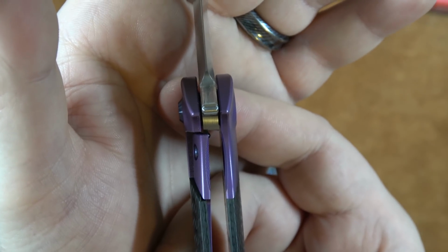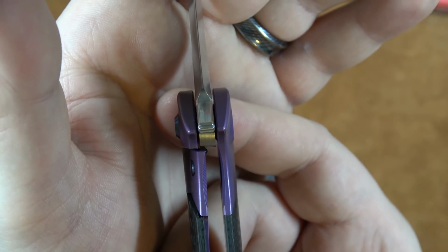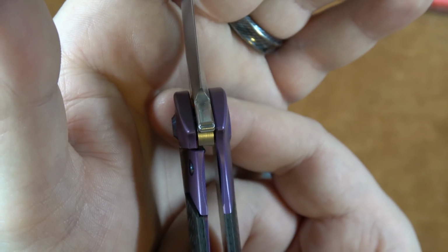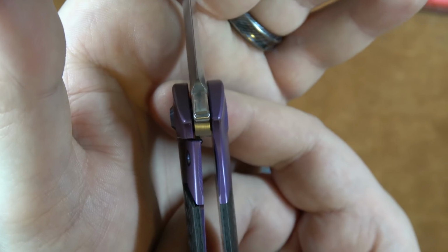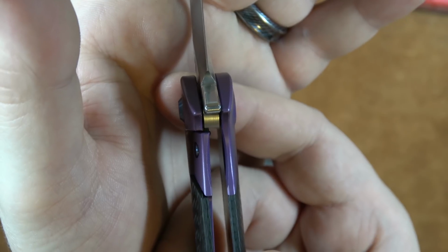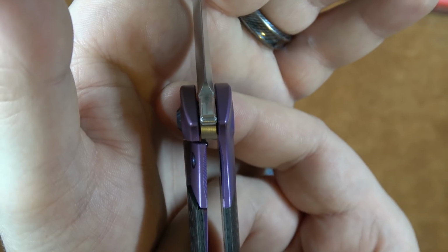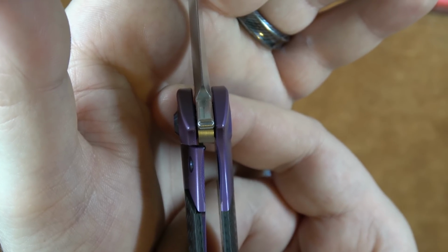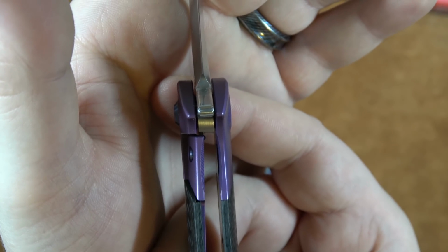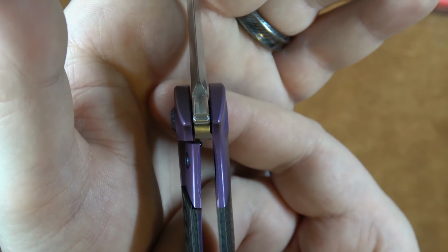And oh my God, some company needs to fix this, because, okay, hang on. Hang on. The little lock bar piece down in there, and I don't have one out here anywhere to measure, but we're talking between 40 and 60 thousandths. That's as thick as it is. That's the most amount of interface you are going to get between those two parts. So as long as you're getting that interface between those two parts, you're good to go. Don't freak out about it.